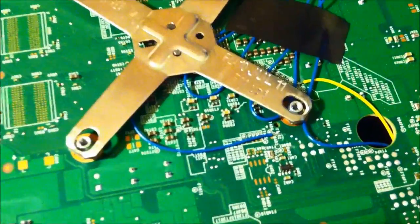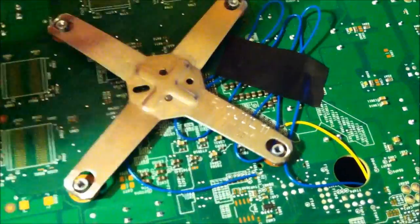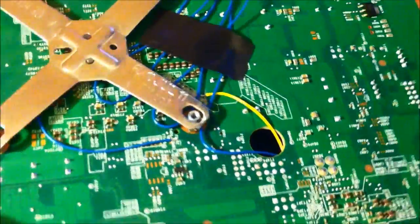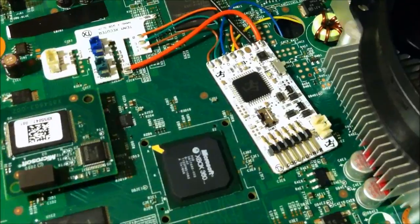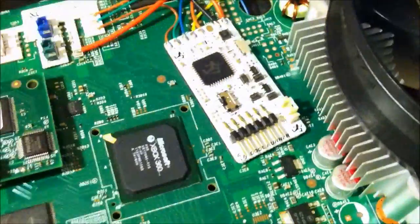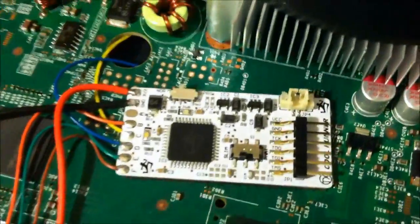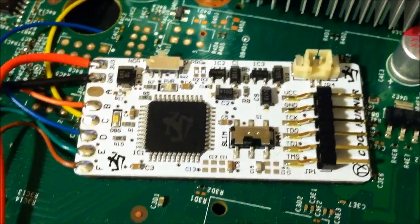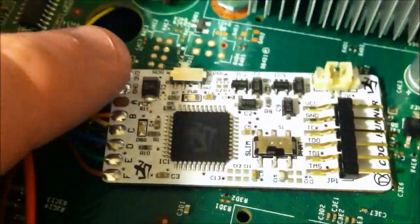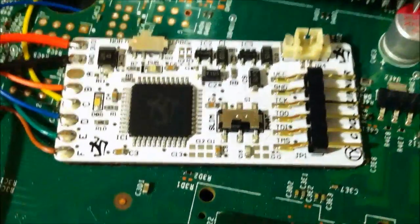Okay guys, this is the back side of the board — I'll have pictures for this as well. I bunched the wiring up and taped it down. I've got everything soldered up and ready to go. I angled the corner so it didn't rest on any of the resistors on the board — that way, in case I ever need to remove it, I won't risk ripping off a resistor. Everything is wired in and ready to go. Make sure you've got the switch flipped to 'Slim' and this one flipped to 'Normal' up here — that way it'll work correctly.